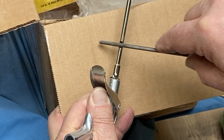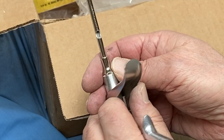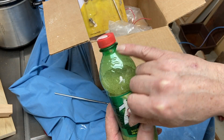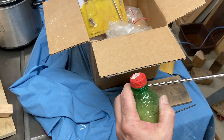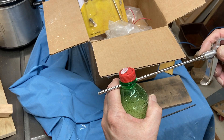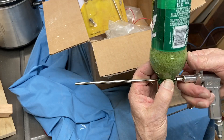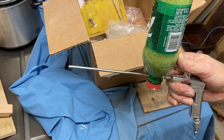I filed away until I had about a third of the way through, so there was a little opening, and I put the opening on the bottom of the tube. It seems to draw the powder just fine. Then here's just a plastic bottle — nothing special. I drilled a hole to fit the tube tightly and you simply stuff it through there, flip the bottle upside down so that the walnut shell is around the tube, and as the air goes through the tube it draws it into the airstream — it sucks it up off the bottom.